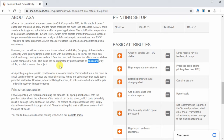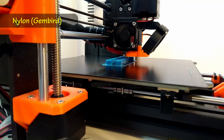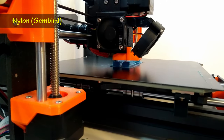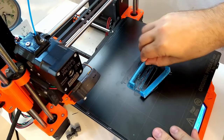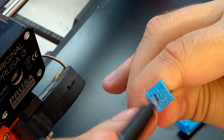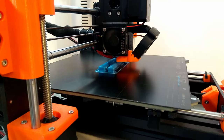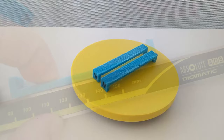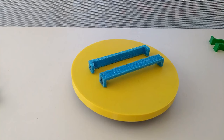The seventh material is nylon by Geeetech, and I have this only in blue color. Sticking to the bed I used a glue stick, but I had a lot of problems with printing because of moisture — I used this spool straight from the packaging and thought it would be dry, but it wasn't. If you can hear those short cracking sounds, those are boiled micro-drops of moisture. I know I should dry the filament before use, but I got my test probes. They are very ugly, but for this test they will do the job.